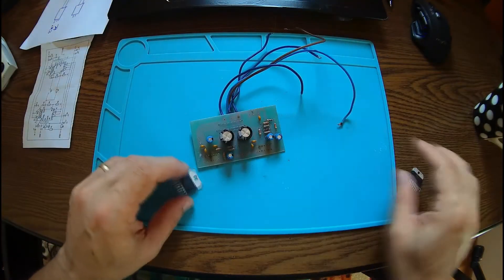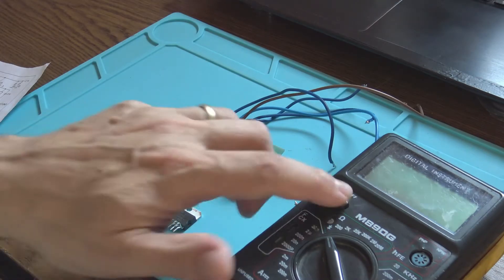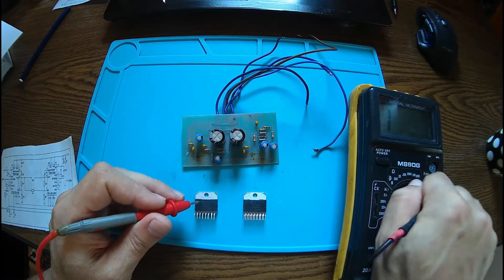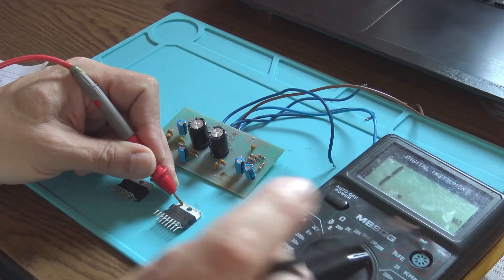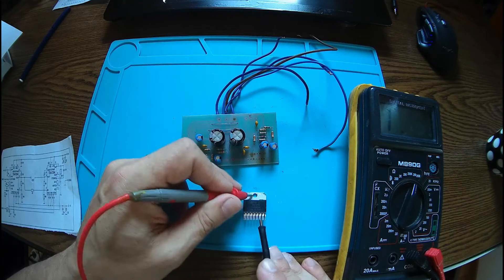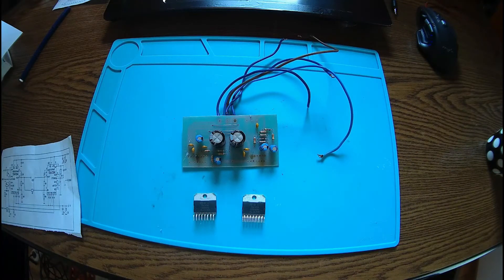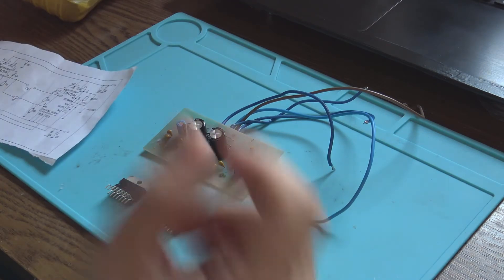The point is to find out if these chips are compatible for use in bridge mode. From the schematic we know the heat sink is connected to pin 8. I found out that if we measure pin 1 with pin 8 we shouldn't see anything on the ohm meter on any scale — I'm on the 20 megaohm scale. That's a way to find out if the circuit is genuine or a fake. In my latest videos I had one about fixing a very destroyed amplifier, and I was unlucky enough to have four fake ICs — they blew up the moment I connected the power supply.